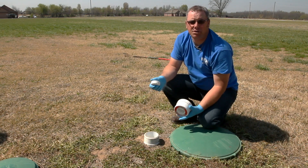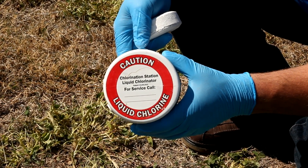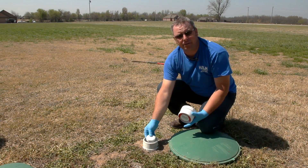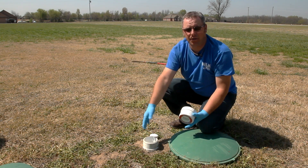This is the chlorination system where you're going to pour your bleach and/or put your chlorine tablets in. If it's a liquid chlorinator, there'll generally be a label stating liquid chlorination. If it takes tablets, it's two to three tablets a month — simply drop them inside the tube. If it's a bleach system, pour in three gallons of bleach a month. You can purchase Norweco chlorine tablets from Lowe's in 10-pound buckets, or also from us. Use non-scented Clorox bleach for chlorinating. If you have a drip system, chlorination is not needed since the water is pumped and stays underground.